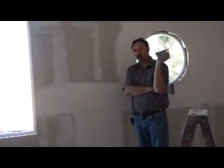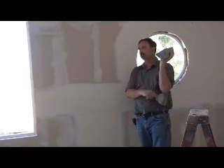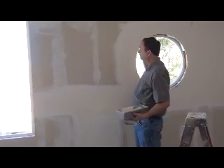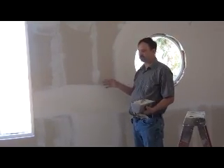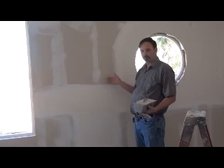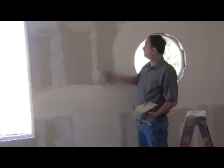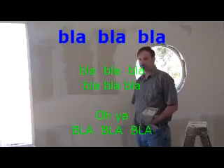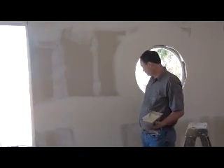You can sand if you want — I particularly do not. The next video clip you'll see is the finished product. I'm not going to spray texture on this job; actually I'm going to recoat everything on this wall. I'm putting what they call a Spanish texture or Venetian plaster kind of finish on it, and I'll show you that later. Everything is going to be covered with a trowel and with little lap marks, so it looks like the old-world European Venetian plaster kind of thing. So that's where we go — we'll be right back.